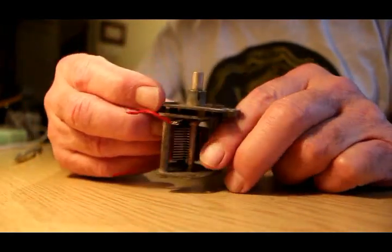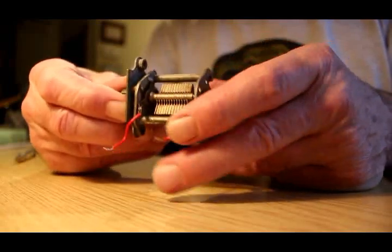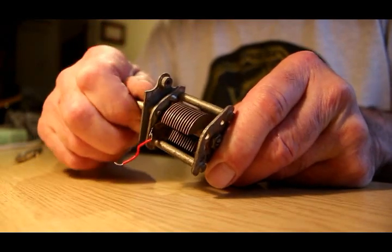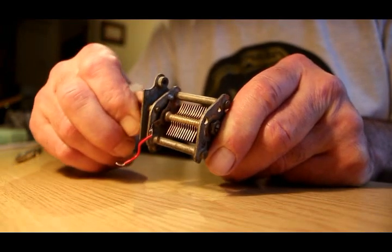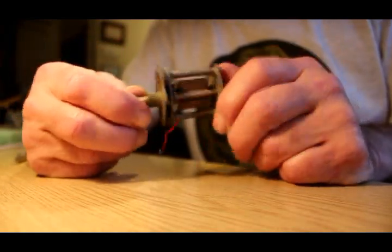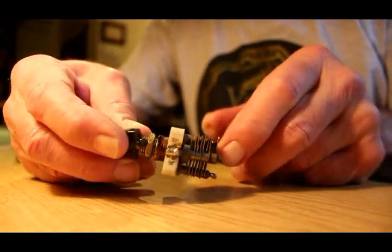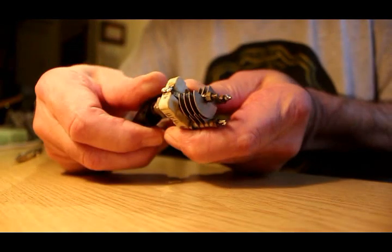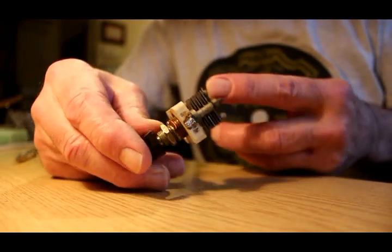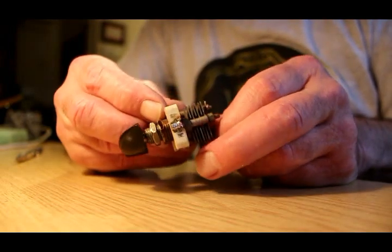This is another one from the same rally — again a pound. This one is 100 picofarads, so you'll see the plates are much smaller. It wouldn't be any good for a crystal set because 100 picofarads isn't large enough to tune in or tune out the station we want, but it would be very useful for a shortwave radio. Here's one smaller still with very few vanes set quite far apart, giving a capacitance of about 15 picofarads — good for fine tuning on a shortwave set.